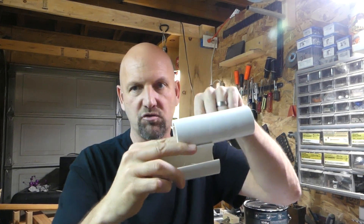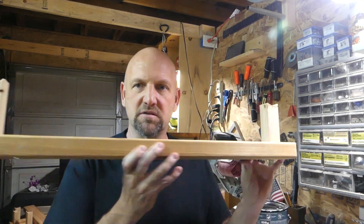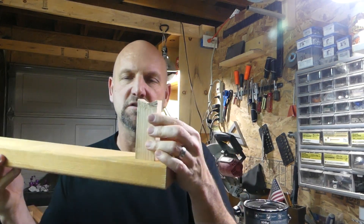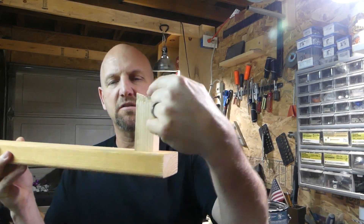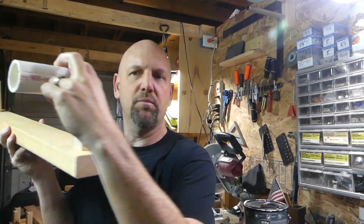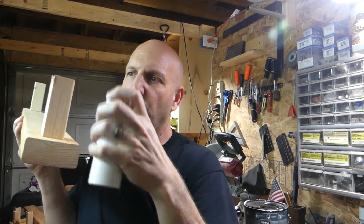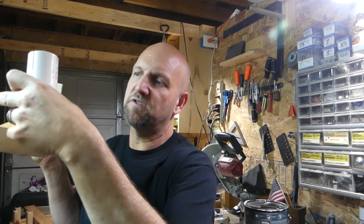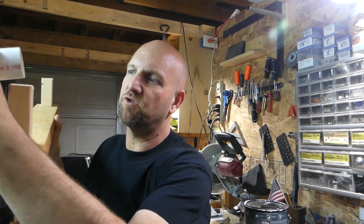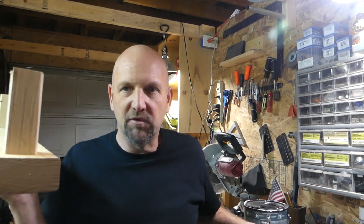When you put your screws in from an angle, make sure you capture both this inner piece of pipe and the outer piece. Also, wherever two pieces of track meet at an upright, the 2x2 is a little small, so I made those uprights with 2x4s instead. That gives more room to work with and screw into where the two pipe ends meet.